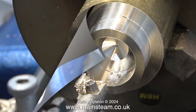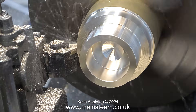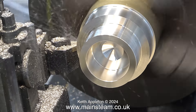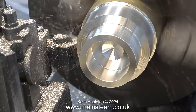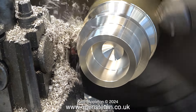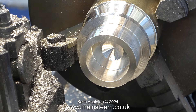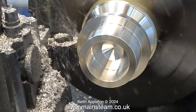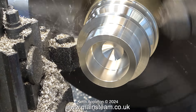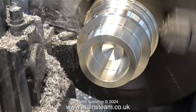This job is a bit different - I'm getting quite a good finish. By the way, in this video it's not a good idea to take note of the cutting speed because everything is running at an accelerated speed. In this clip I'm using the same negative rake carbide tip tool that I used in the Comedy of Errors video, and even though it's a bit blunt I'm still getting a good enough finish for what I need. It's a good idea to use a piece of cardboard or paper to deflect the chips away from you.